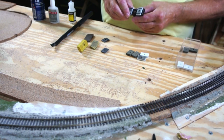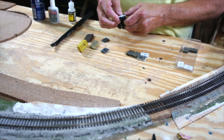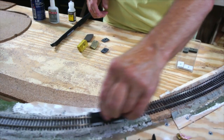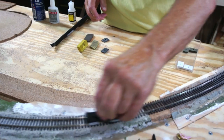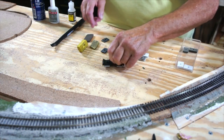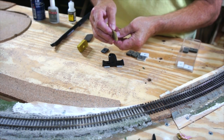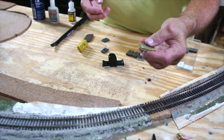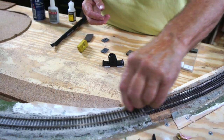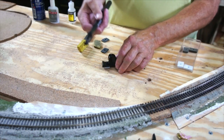And one other thing is, they recommend turning this thing over here whenever you're doing a grade crossing or a turnout, so you don't get into the points and into the guides, the rail guides, to turn it over like that. But what I normally do, and I've done this for years, and you can tell on here I've worn out a groove in here, is on my turnouts I'll put it on its edge and go like this, and so where you have the guide rail right next to there, it gets down in there. They have a handle for this also,